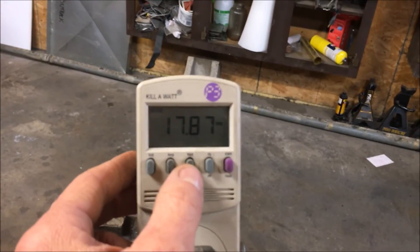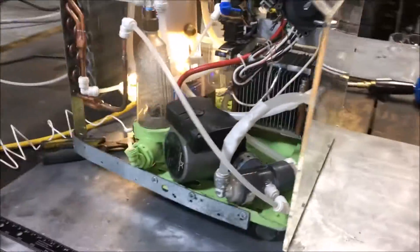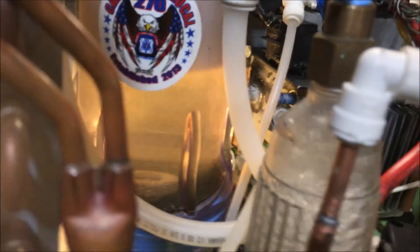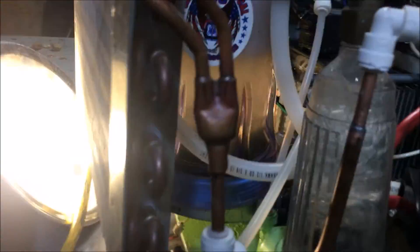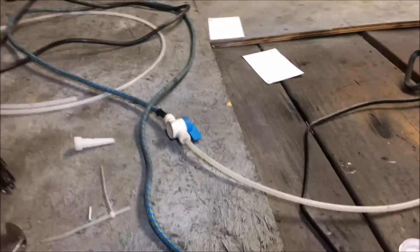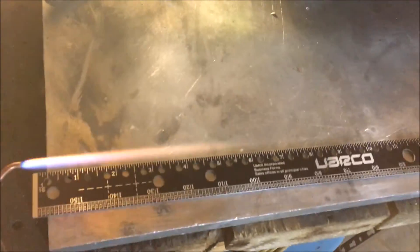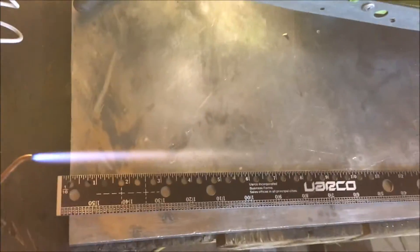That's quite a bit of power — I had to amp this up for that tip. The other tip wouldn't handle that current. There's almost 2000 watts at full power. When this cell heats up we'll go ahead and let it hit 2000 watts and take a look at what a 2000-watt flame looks like. They're currently at 115 degrees on the electrolyte. We're gonna give a little stress test to the cell. The sonic transducer is on — I'm going to turn that bad boy off. There it is guys — 2022 watts. That thing is screaming.